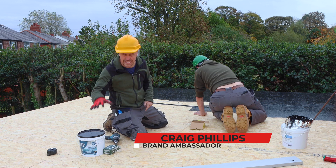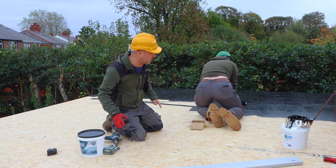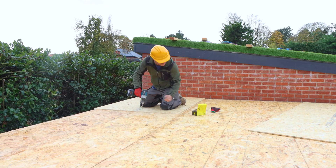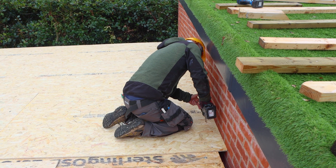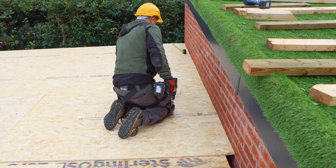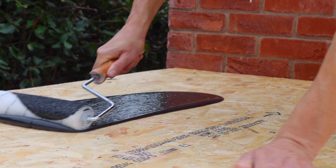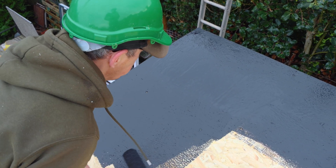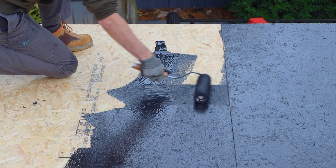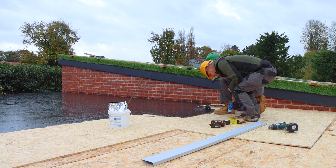The great thing about this rubber liquid jacket is you can get your roof watertight very quickly. We're overlaying the boards down here, screwing through into the SIP panels below, which have timbers inside, so the board bites down with no movement. Stephen is applying the first coat, rolled on for a quick and easy finish. Once it dries, we'll apply scrim tape across the joints to reinforce them, then a second and third layer.